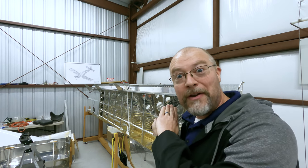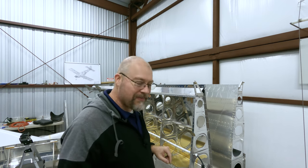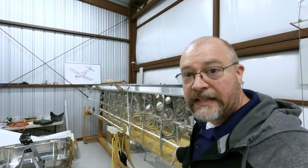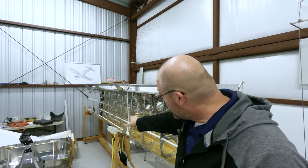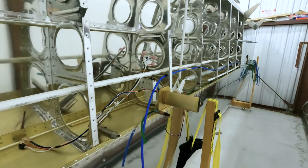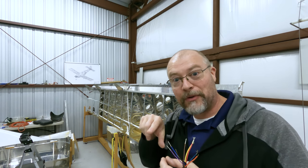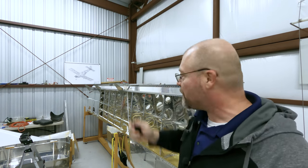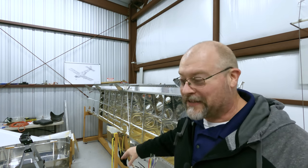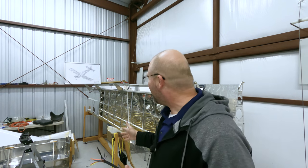My wings have been in this state since February 2017, so it's time to get them closed down. On this wing I need to get the wiring and servo done. The other wing is a whole other ball of wax — I've got the wiring plus a heated pitot tube to install, including cutting the space for it. There's a lot more on that other wing. At least I can get this one done, and then I've got to finish the fuel tank because that one leaks.